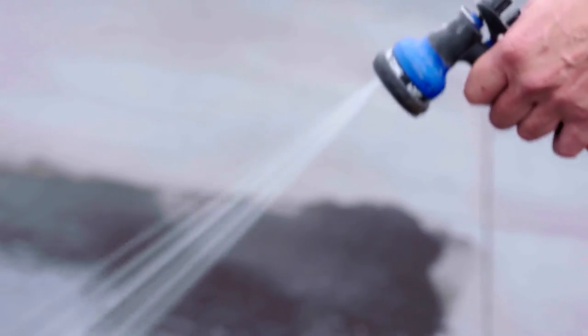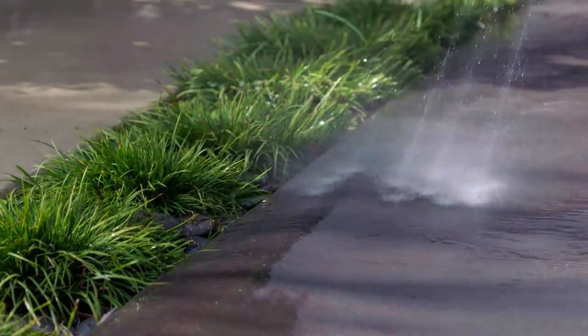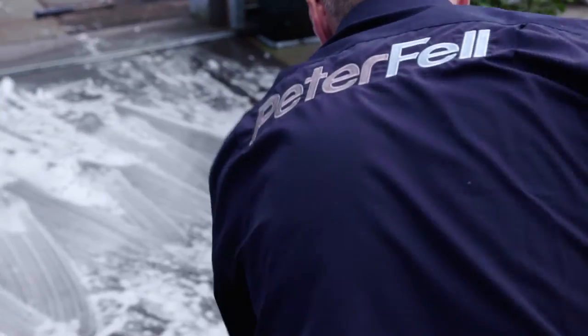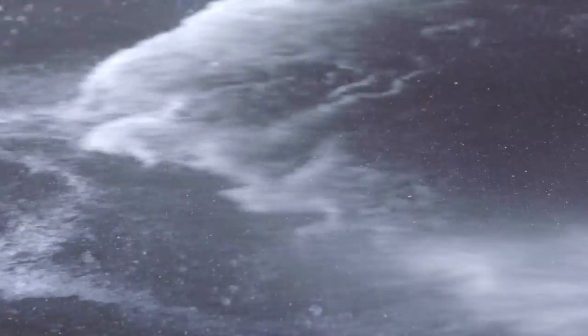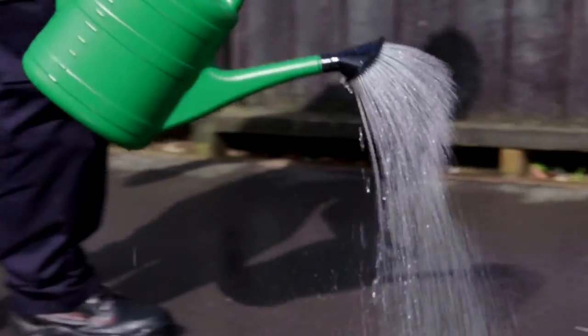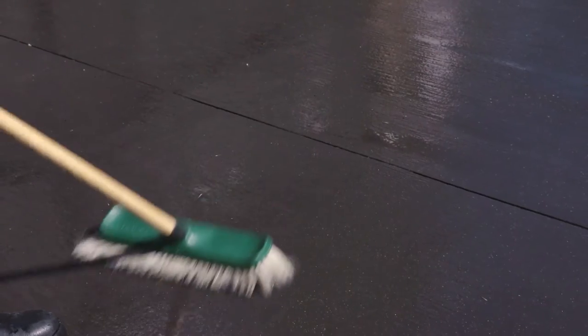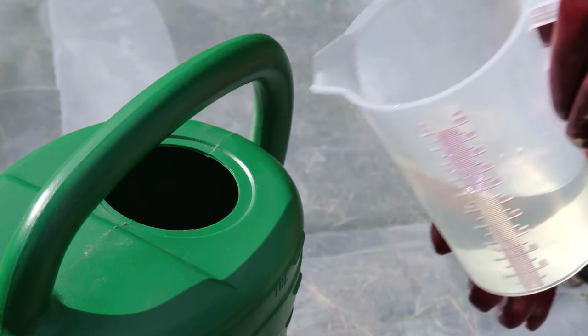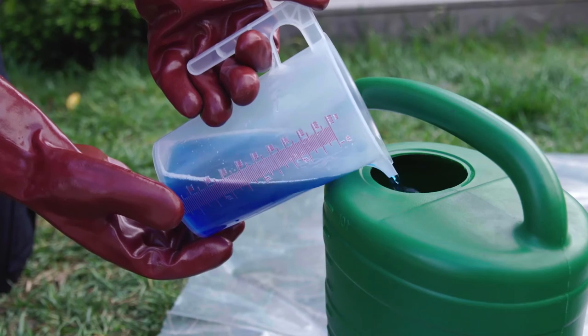Small amounts won't do any harm, but it's good practice to immediately apply water to the affected area. After 2 minutes the reaction is complete, and it's time to apply the neutraliser solution. Ensure the neutraliser is visible on the surface of your concrete. Use your broom to disperse it and leave it for a few minutes before hosing off. Having completed your test patch, you can now repeat the entire process in manageable chunks, taking care to avoid treating overlapping areas and working within the existing cut lines in your concrete. Note that 10 litres of each solution will allow you to prepare 8 to 12 square metres, so if your concrete is larger, you'll need to mix and apply further batches of both solutions before hosing off.